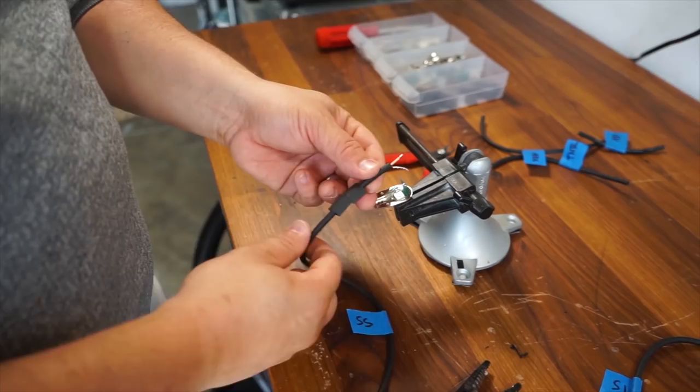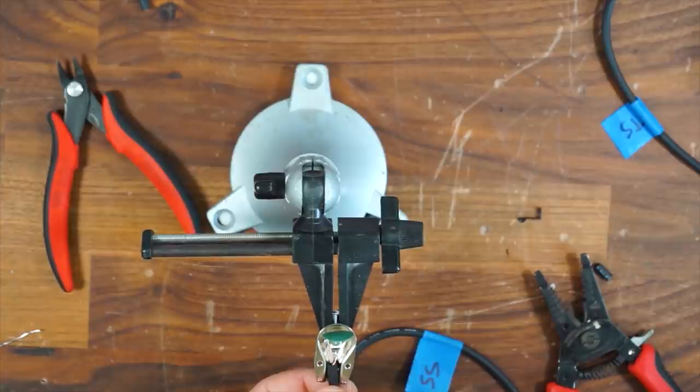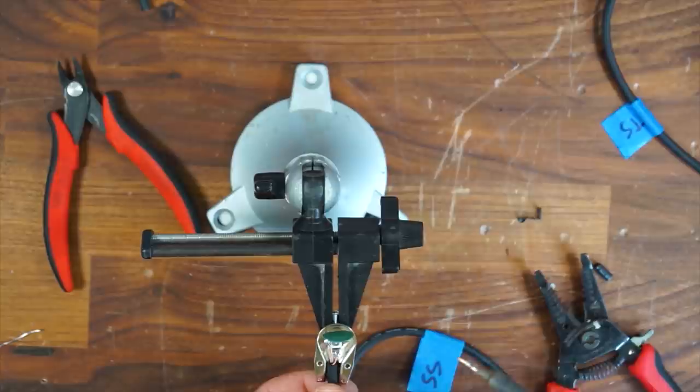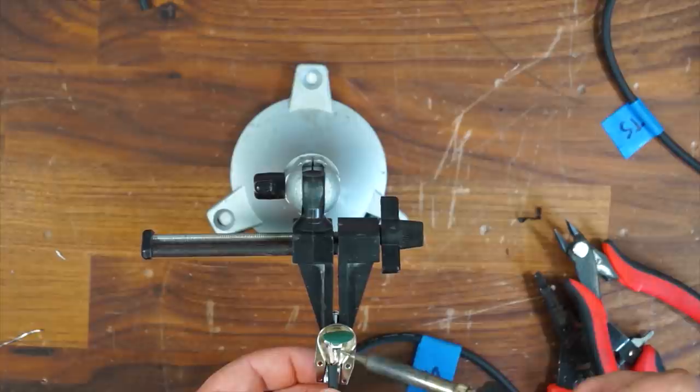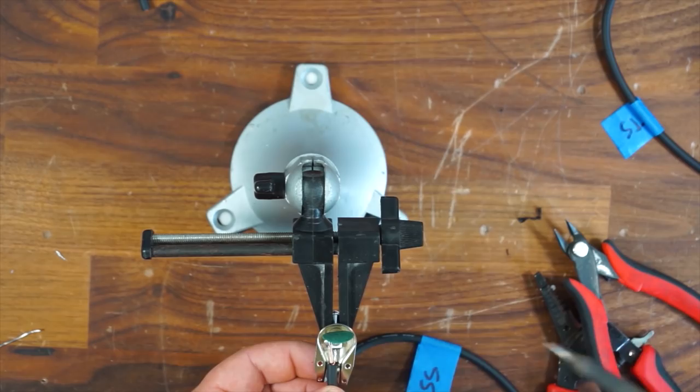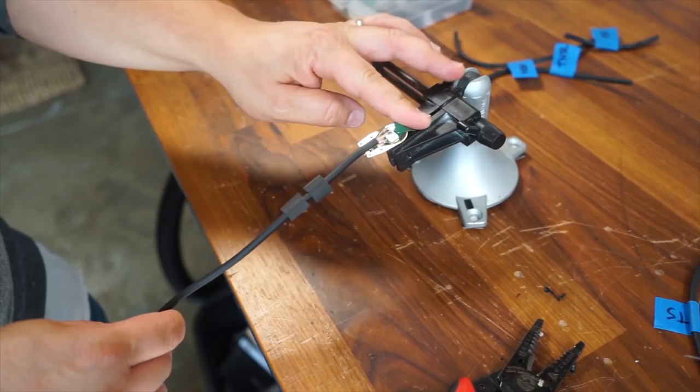And I'm going to kind of size up where I need to put my tip and my sleeve. And I'm just going to solder that down. That's perfect for the tip. And I got a little extra of the shield wire there for the sleeve. So I'm going to cut off my excess. I'm going to kind of bend it into place. I'm just going to press down on that. Perfect. Got a little extra sticking off there on the tip, so I'm going to get rid of that. I have a nicely wired cable there. That's my first end. It's looking pretty good.